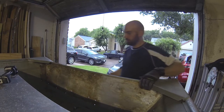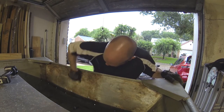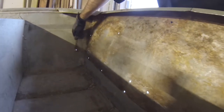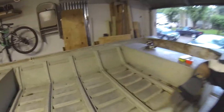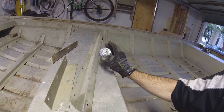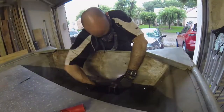Alright, the next thing we've got to do before we even put the wood in is we're going to have to cut the wood, but first we need to clean up this corrosion that's already sitting in. We're going to sand all this down, get it nice and clean and shiny. Same with those parts we removed — the brackets here. We're going to go ahead and clean these up, hit them with a wire wheel, then hit them with a coat of metal primer.